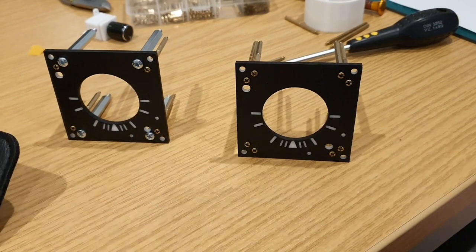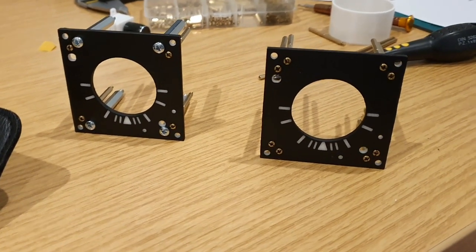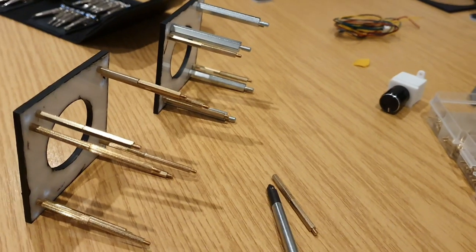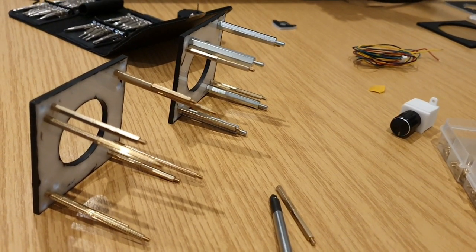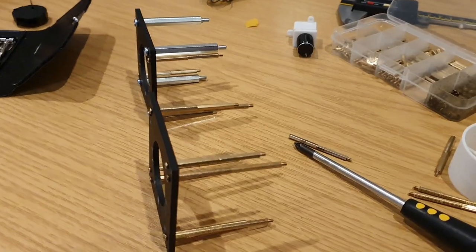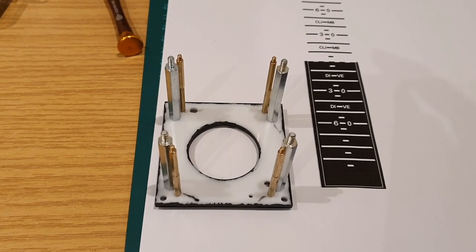I did produce two slight variants of the fascia, the only difference between the two being that one would accommodate 3mm spacers. Although it does make sense to use a thicker spacer, particularly for a panel that's going to be suspending in place a large number of components, for this particular panel the dimensions are so tight and there's so much we're trying to fit into it and get it squeezed into the front dash frame, we need to shave off every millimetre where we can.